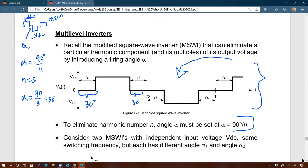If you look at harmonics losses, this is going to be big. Oh, switching losses. Very good, switching losses, yes. Because this inverter utilizes not much switching, right? It's only 60 hertz switching. There's no high switching here. There's no high frequency switching. Whereas PWM, as you learned from EE411, uses a lot of switching, right? It has a low frequency and very high frequency.